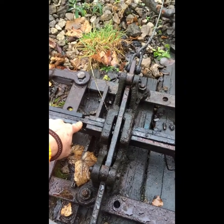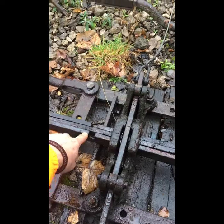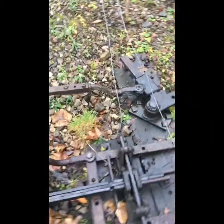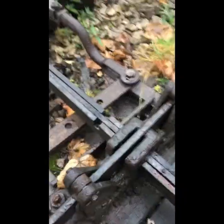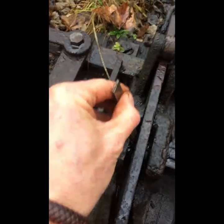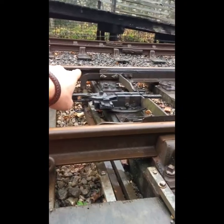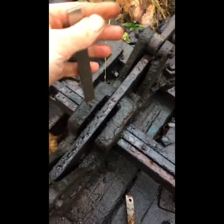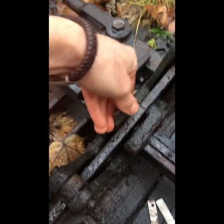Your notches in these — once you've cut them — you want a 2mm clearance down either side, so we have a 2mm gauge for that. Going back to our point gauge: there's a 2mm point gauge. We have a gap down here of 2mm — that's no problem. That's on our locking face. The point is up there on that rail, so this detector on this side — this is its locking face. A good 2mm. Our 5mm again should not enter.